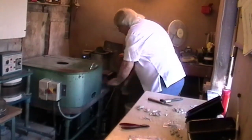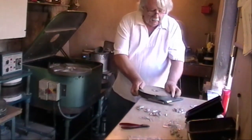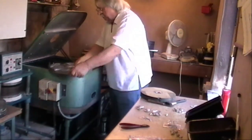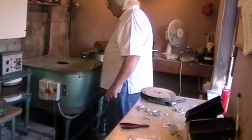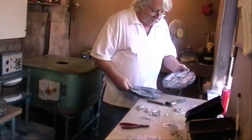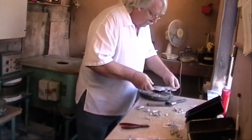That back down there, and round we go. Open the machine, take the mould out, the next mould goes in the machine, you put the top on, press the button, and round it goes. You powder the next one, you undo the next mould, which has just been cast, is the shepherd's hut. With all that one spinning, we'll strip that one out.